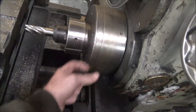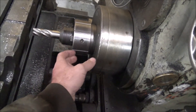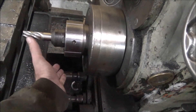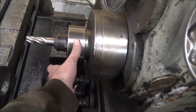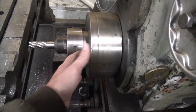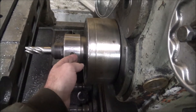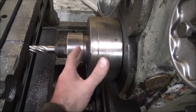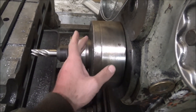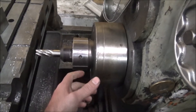This mill has a device mounted on the spindle that you can crank down to stabilize it. It's basically a squeeze collet that squeezes onto the spindle to stabilize it for milling operations, helping to take out any of the play that's in there — because there's got to be play or you couldn't move it in and out. It's also got some wear adjustment, so you can use this to take up for wear, or run it in a spot where it's already tight. It gets tighter and looser depending on where it is, so you have to run it loose enough to traverse the whole length, or just tighten it down and use it in that one spot.